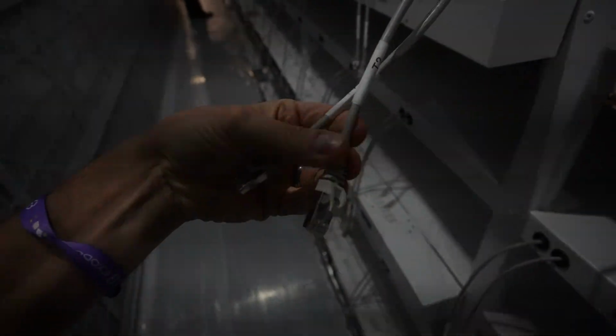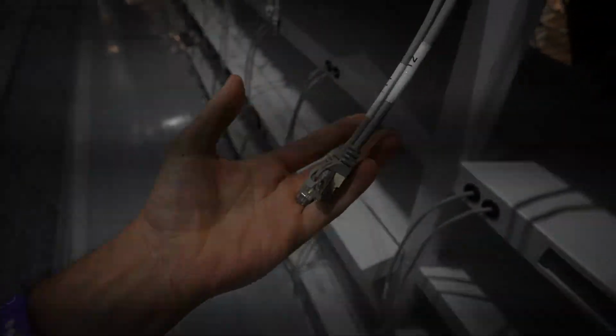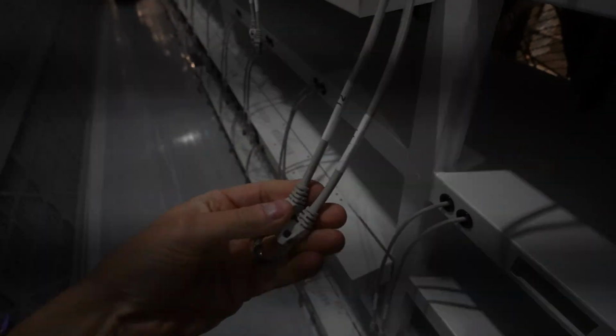Anyway, okay. So, then you got your Ethernet connectors here. The Ethernet connectors are also kind of important, I would say, because some containers install cheap ones, and then over time, after a couple of years, they rip, they tear, your connection gets lost, and you have to redo the wiring. It's really annoying. So one of the things we check on our containers is the quality of the Ethernet connectors. And the quality here is pretty decent. I wouldn't say it's super high quality, but it does look pretty decent. It doesn't look like it's gonna rip too fast or anything like that, so not bad.